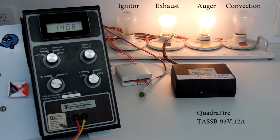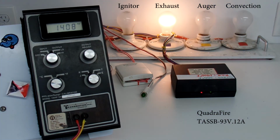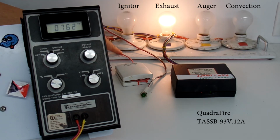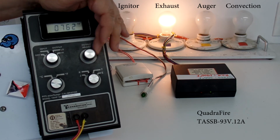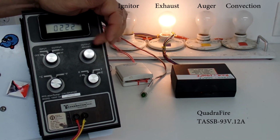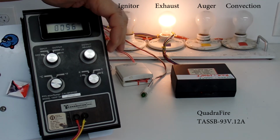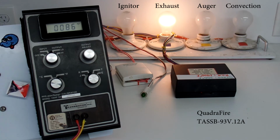If you happen to walk into the room and you shut off the thermostat, what happens is there's no more pellets being driven into the fire pit. Those pellets that are there will continue burning. Eventually the temperature of the fire will drop, and as it drops, we notice that the igniter is not coming on because the thermostat is not calling for heat. And the room will go to the state of approximately 60 degrees Fahrenheit or so, and it'll stay that way until somebody walks in the room and calls for heat again. But that starts the whole cycle again.